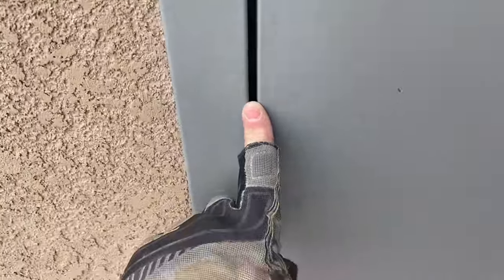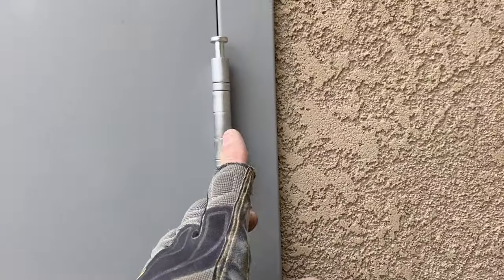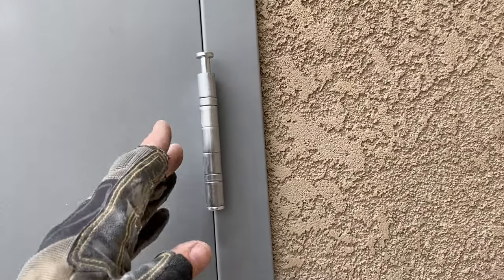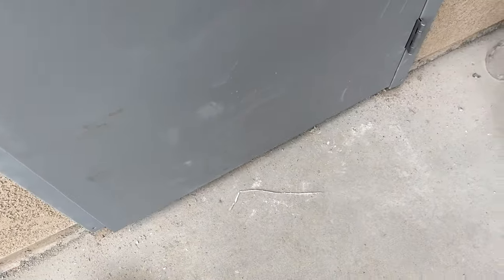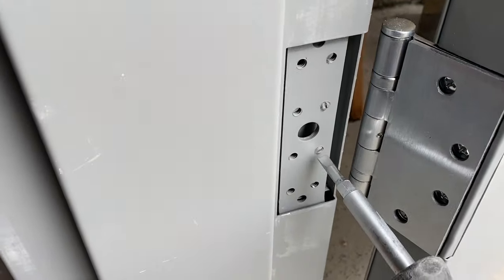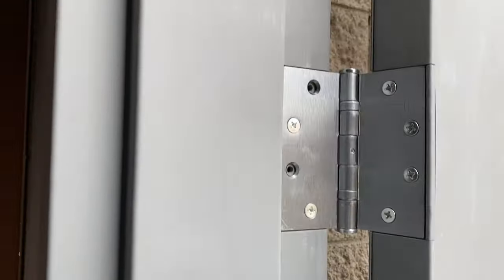Look at that — darn near perfect! Perfect gap on top and a nice even gap on the strike side, but it's a little bit large on one side and has no gap on the other. So we want to take the hinges off and back out those set screws a little bit — that will tilt the hinge and give us a bigger gap on one side and a smaller gap on the other. Everything is flush, nothing is out of angle. I'm not going to pop off the door to do this; I'll just do it one hinge at a time. These screws are flush, so I go one-two-three turns on each, then put it back on and do the same for the other hinges.